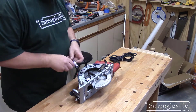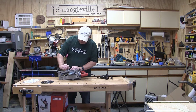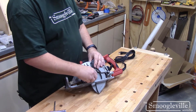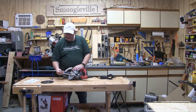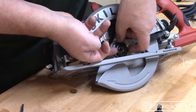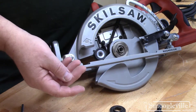What I need to do is figure out how to lock this shaft. Oh, it actually just loosened up. And of course remember when you're dealing with skill saws, it's the opposite - it's not lefty-loosey righty-tighty, it's the reverse. I'm actually turning the other way to get the bolt out there, and that's so that when the thing is spinning it tightens. Now what we've got here is interesting - if I pull this flange off here, that is a diamond shape designed to take the teeth of this blade.